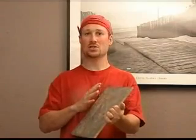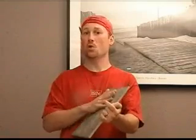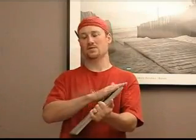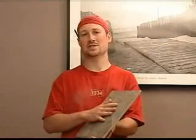One of the main ones is it's very uncomfortable on your feet, and unless these are sealed really, really well, they can stain very easily. Now, if you do use these indoors, you want to actually seal them beforehand. So you would seal it, let it sit and dry, and then lay it down. The reason for that is you want to guarantee that you get all the space. If you try and do it afterwards, it's really hard to get it all. It's a bit different kind of a seal, and you brush it on. So just something to remember too. And you want to get the sides as well.